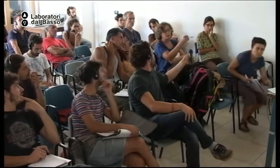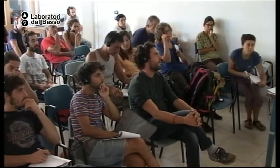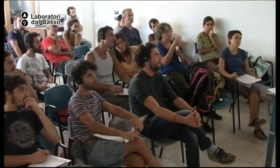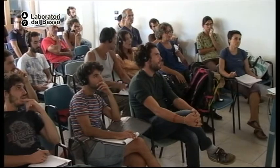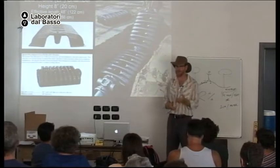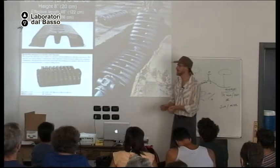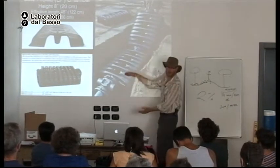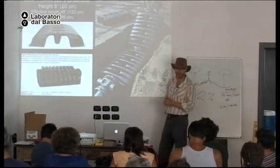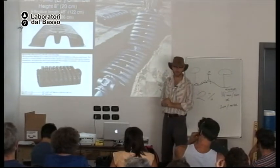He's wondering if this kind of system is used for larger recycling of gray water, large quantity, because it seems awfully big for just, let's say, a washing machine. Yeah. And that all depends on the percolation rate of your soil and the volume of water going to the soil. And you would then size the number of these based on those two numbers. And we will do that exercise after lunch. But yes, this is used for bigger systems too.